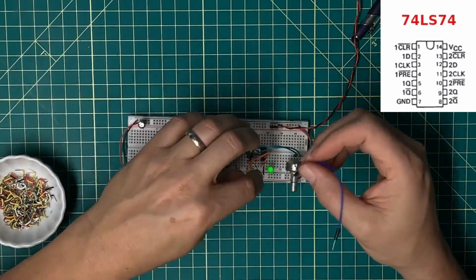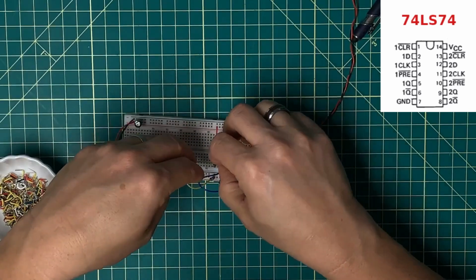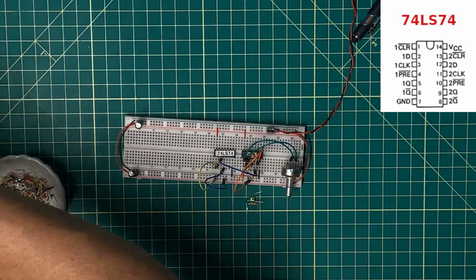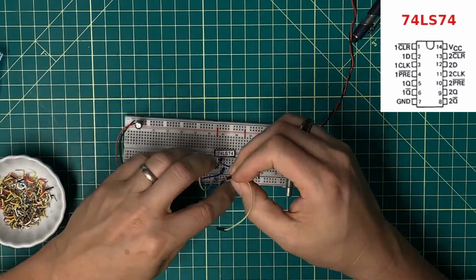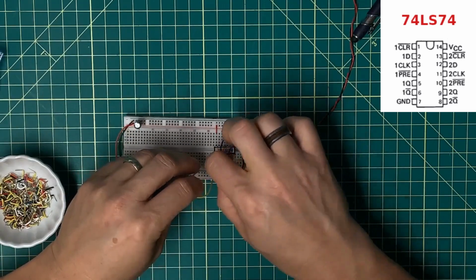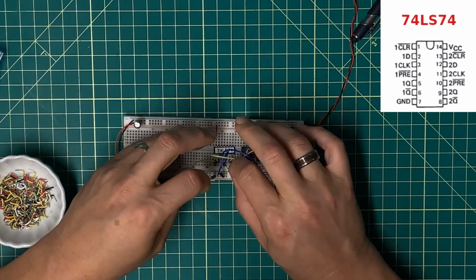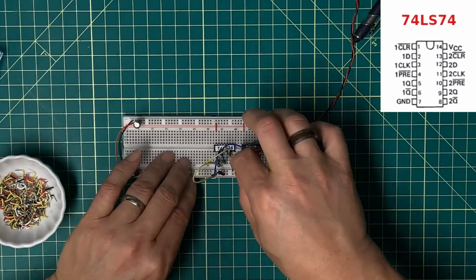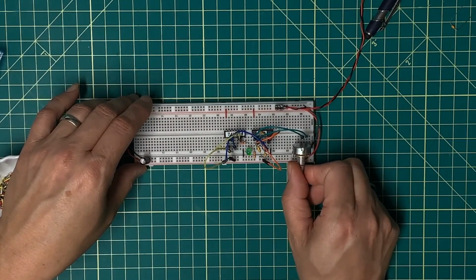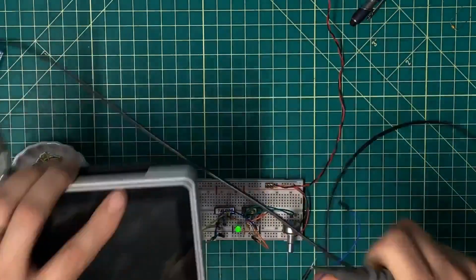And if I take my output here from pin 5 and tie that to the clock, which is on pin 3, then I can take my LED out. What else is it? It is the inverted Q, pin 6, goes to data, which is pin 2. Then my Q output here, which is pin 5, if I bring that out and put the LED in there, I still get a good oscillator. But now I should be able to measure that and see a 50% duty cycle.